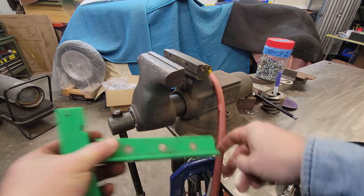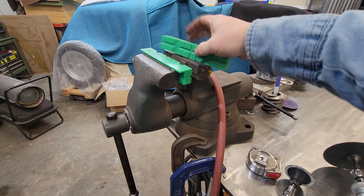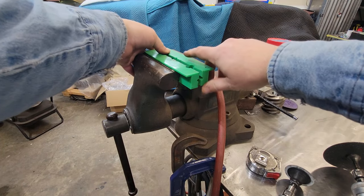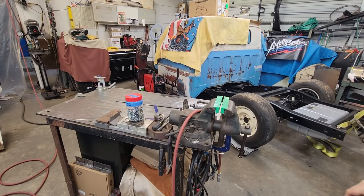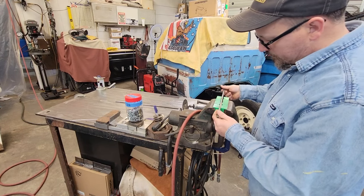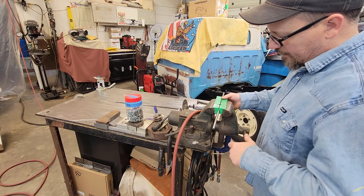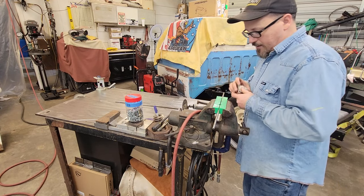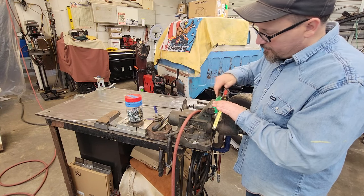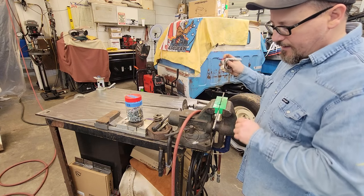These are the magnetic soft jaws — they're plastic with little magnets in them, they just stick right on. They keep from messing stuff up and have little angle holes for clamping. I'm going to run the quarter-inch rod out about five or six inches so I don't have to re-clamp. We'll cut two pieces: two inches and four inches for the two legs. Let's get our grinding shield on — be safe with the cutoff wheels. I think these are Benchmark Abrasives thin wheels. Not sponsored, but they work pretty good.